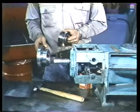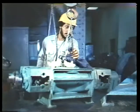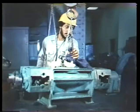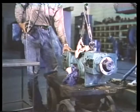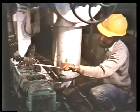And if this pump were being returned to service, we'd have to mount the coupling on the end of the shaft. The overhaul would then be complete, and we could attach the rigging and take the pump out of the shop. When it was back online, we would reconnect it to its bed plate, motor, and piping, and of course, run an operational test.